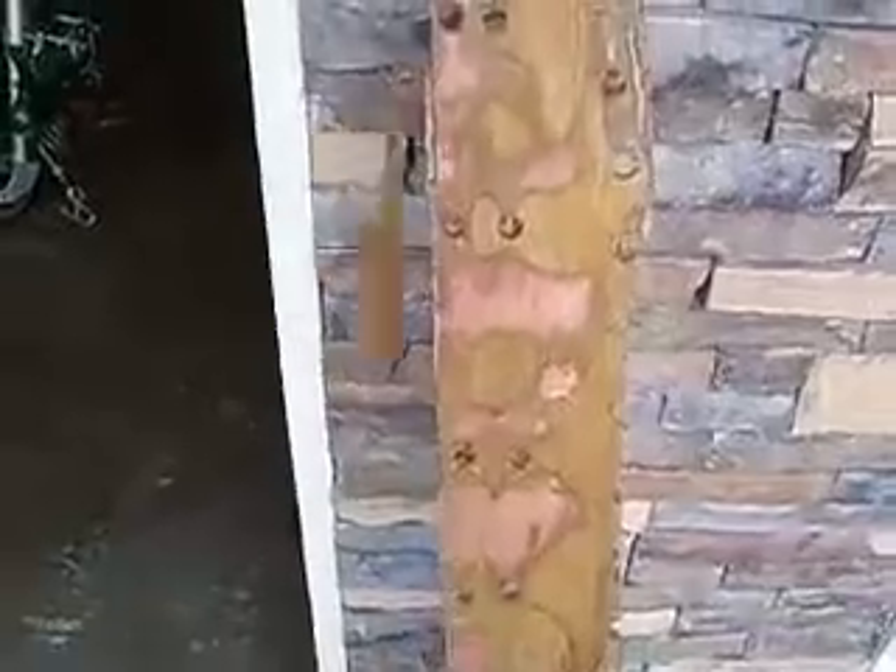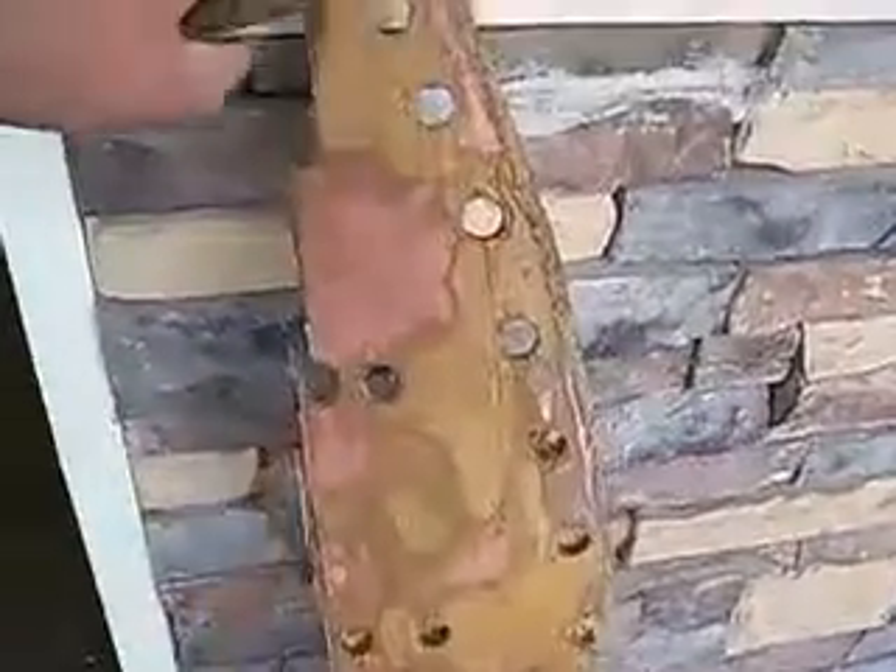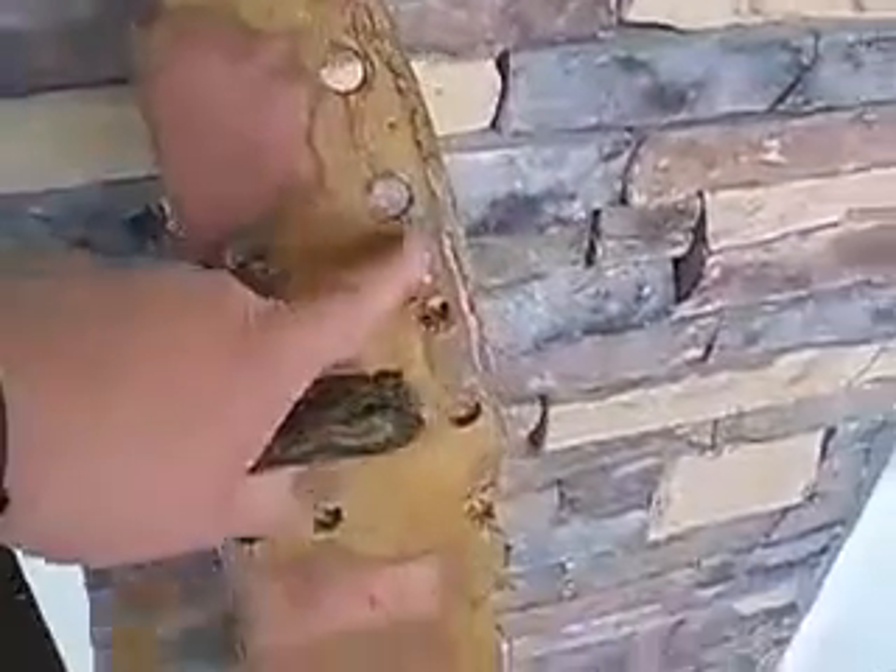Hey Tom, this is Paul and Josh. I want to show you your plank — we snatched it off of there. You'll notice, since we knew we were replacing the plank, we get them off really quick. We use a core drill and we drill around the fastener, so that's why it looks like Swiss cheese. And we protect the edge so that we can use the edge to copy the new plank.